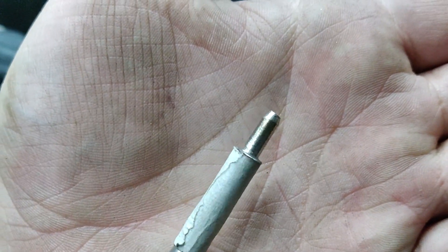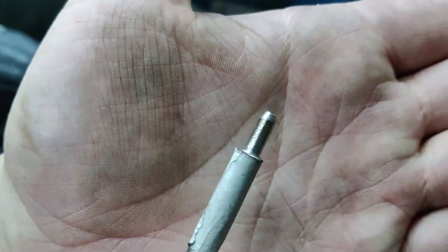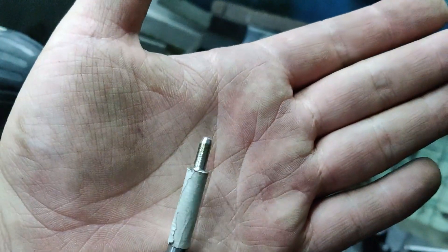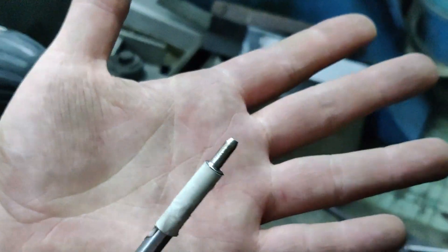We've ground the rest of that end down to about the diameter of our initial cut — around 4 millimeters. You want it to be under 4 millimeters for sure, but a little under is fine. Don't go below about 3.8 millimeters or your threads won't be deep enough and won't bite into the rod end as well as they should. It's not totally centered but it's very good for the tools being used. Now I'm going to finish off the other end and then move over to the die.